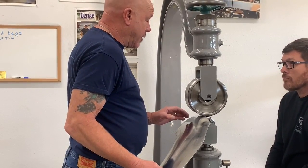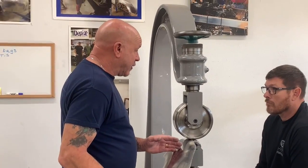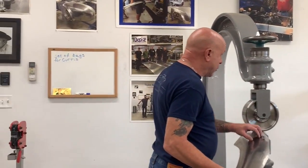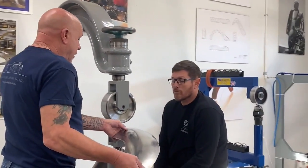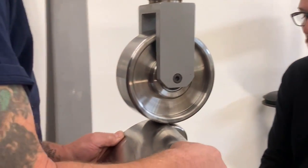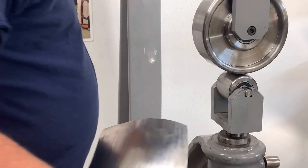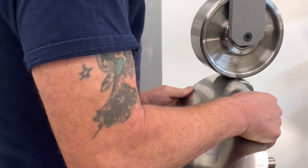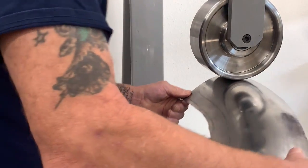And at the same time, I'm going to be able to keep my blows nice and overlapped and be able to create more shape at the same time as smoothing, at the same time as slightly giving it some English and pulling it down. Okay. So I'll do the first little section for you. What we'll do is adjust our pressure to more of a shaping and smoothing.